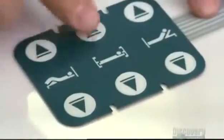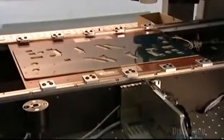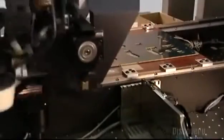This control panel is for a hospital bed. Some membrane switches have a light-emitting diode, or LED — a tiny colored light that goes on when you press the switch to confirm contact. The factory's robotic machines deposit two drops of epoxy paste containing silver on the circuit layer wherever an LED will go. A robot then picks up the LEDs and deposits them on the drops of paste, then puts a dome on each circuit creating an electrical contact. A red light from a camera checks the positioning.